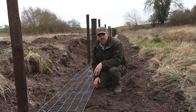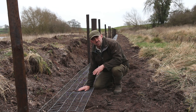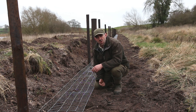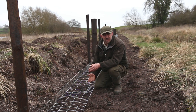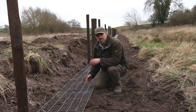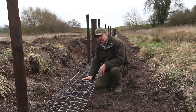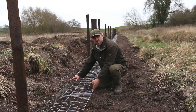If the ground is undulating or you've got bumps on this line, that's going to kick it all out - it'll still work, it just means when you come to cover it you're going to need a lot more soil on it and possibly more hog rings to pull it all up, so a little bit more work. It's not the end of the world - it just depends on your manpower and how quickly you need to get the fence up and how you want it to look. But this is the ideal scenario: something nice and flat creates a nice line and rolls out much much easier as well.